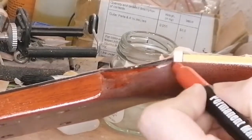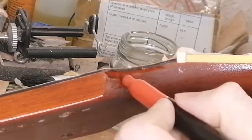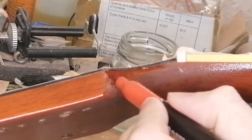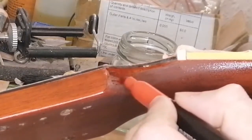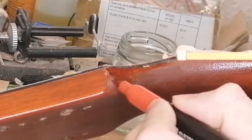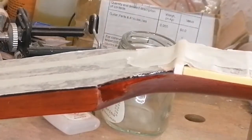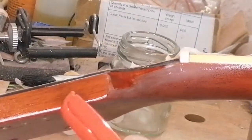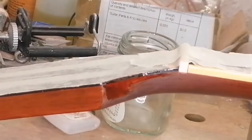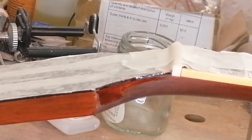I'm probably thinking it looks a bit too dark. Well, once it's dry, I'm just going to very lightly go over it with steel wool. The pen, specifically. Not going to touch any of the other areas. So that will help blend it, not have it stick up too much. And then when it's all clear coated over, it's all going to go a little bit dark anyway. Because if you look there, that's what it's going to go to compared to how light it is here, because of the way the scuffed surface is refracting the light. Actually, refracting in a sentence, that's a bit unusual for me.